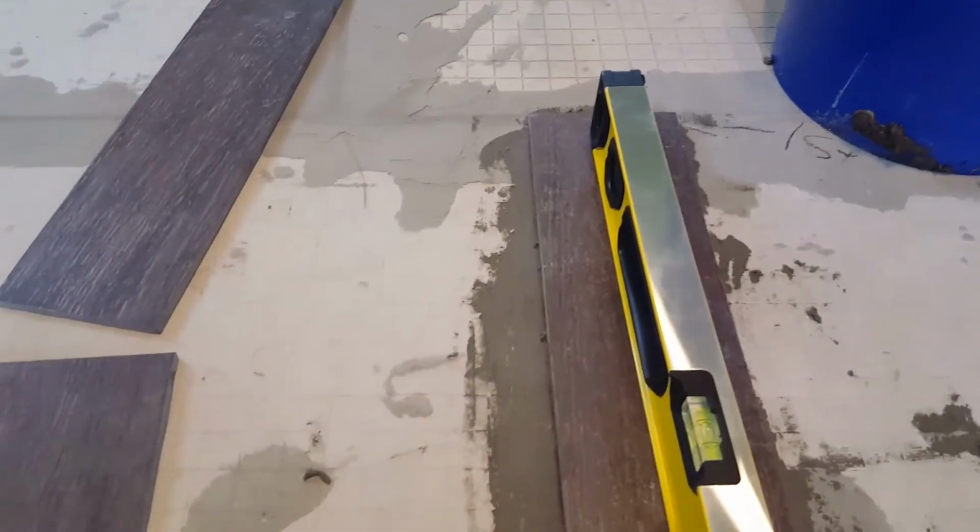It also makes it much easier to see your lines. You don't want any gaps, especially in the corners here, like this is no good. So I'll take this. I'm going to build my corners up. I'll do this better when I've got two hands, but essentially that's the practice. You're going to support the tile with the other hand. Just keep packing it in and filling it up. All right, that's our first set tile, so let's get to it.